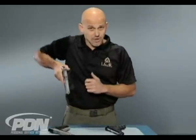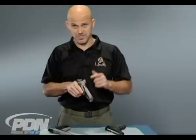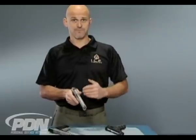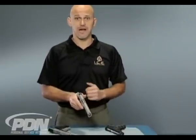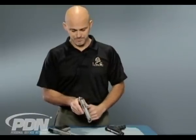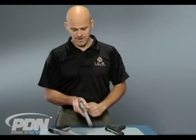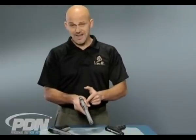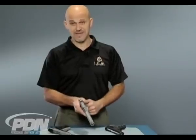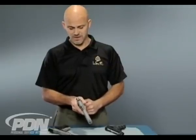Obviously, I can come up out of the holster and snap it off very efficiently, but when it comes to getting back into the ready position, I want to be just as efficient with a single action trigger getting that safety re-engaged. Maybe not as important in terms of defending yourself, but very important in terms of the operation of the firearm in a safe way, reliably, during training, and of course in an actual incident. So what I'm going to look at is modifying the safety on this 1911 or any firearm of this type of design so that it is both wider and maybe a little bit longer. Of course, the length is going to give us more leverage, and the width is going to make it easier to hit reliably both on the disengagement and on the re-engagement of that safety.